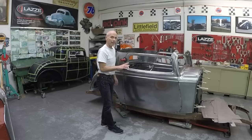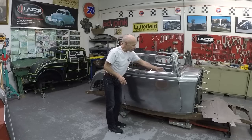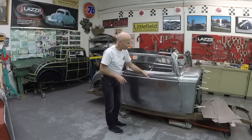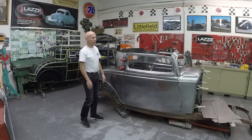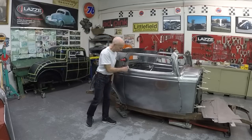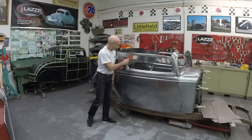The door window frame is made in one piece — so there's no welding on that one at all. It's a 90-degree angle that goes in and then down, and that's going to be flush to the glass. That one will be welded in, but the outer shape is one piece. I made one first so I could find out if there were any difficult areas to figure out before the class, but everything was pretty straightforward. The corners here are sharp — a '33 or '34 is more round, so that's easier to do.